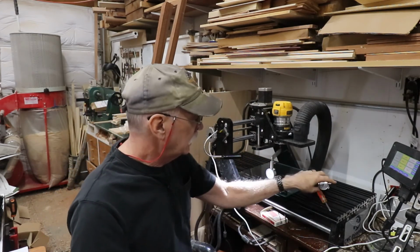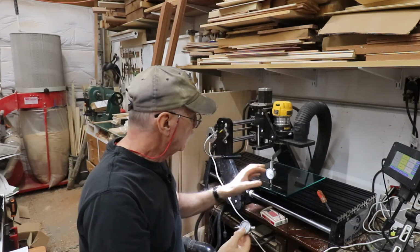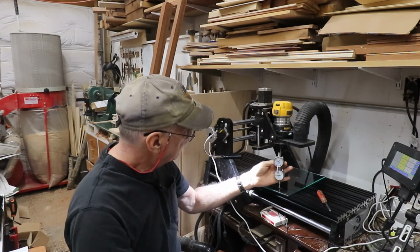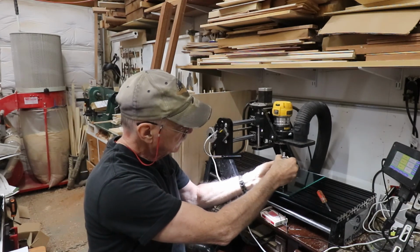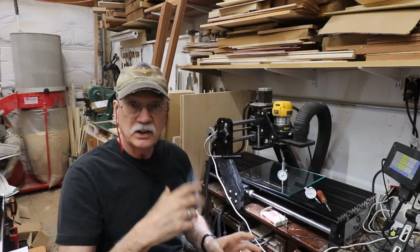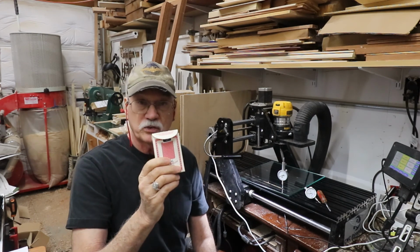So what I've done is I've got another dial indicator that has the quarter-inch hole tab on the back. I'll remove this pin here and then screw that together there. Then I can get about 2.5 inches lower towards the glass, and I can start tramming. So I'll end this video right here. The next video I'll have all this together and I can take you through the tramming process. Oh yeah, and I got some playing cards for shims to go under the glass. They're very consistent. They're 0.010 of an inch each.